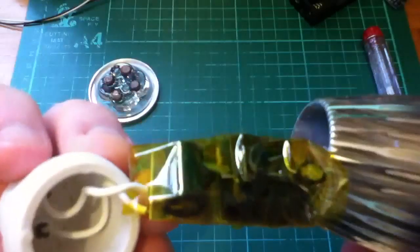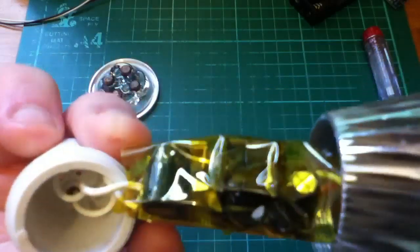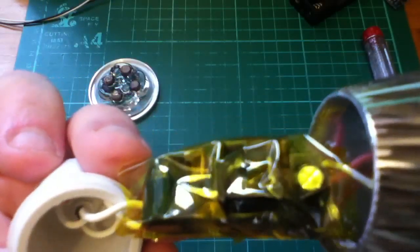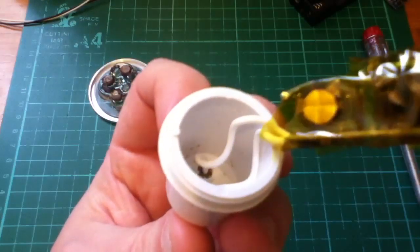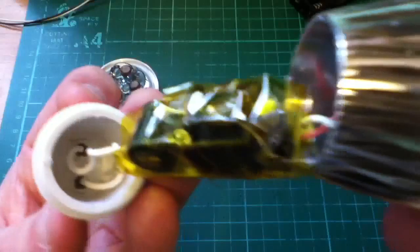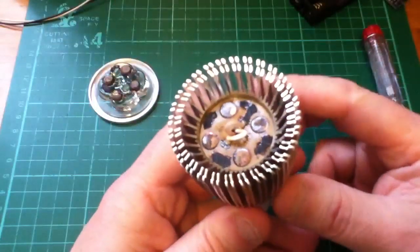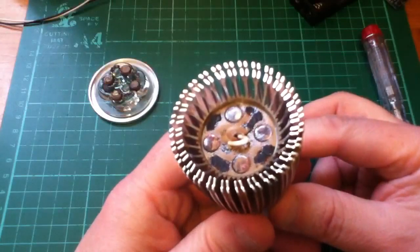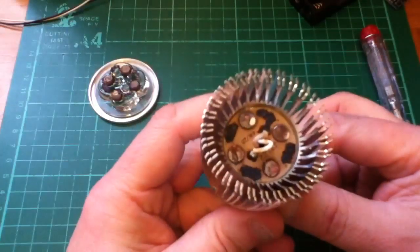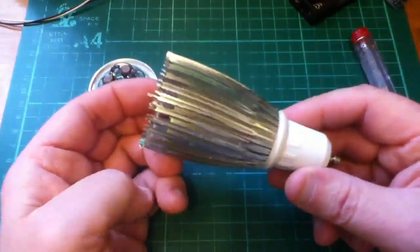We've got a transformer-based circuit there. It doesn't appear that that's got hot — it's wrapped up in tape to insulate it from the mains points at the bottom of the plastic receptacle there, but that all looks intact. I don't think this is an unsafe bulb, and in fact the way it failed wasn't unsafe. It didn't catch fire or anything; it just burnt the tracks off the board, disconnected itself, and that was the end of that. So probably won't be buying bulbs from that particular seller again.